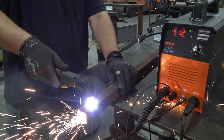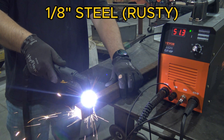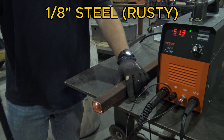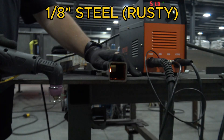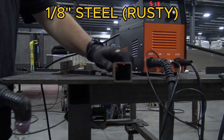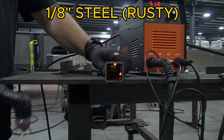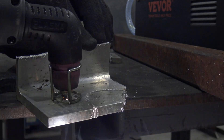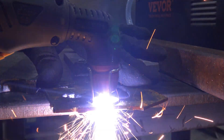Finally, I found some small steel tubing that was about eighth-inch thick but pretty rusty from sitting outside. One of the advantages of a pilot arc start plasma cutter like this is that it doesn't need to scratch start with the material. Normally you need a clean surface for the arc to start, but since this is a pilot arc, it can punch through paint, rust, or oxidation without any problem. If you work with painted, galvanized, or rusty materials, a pilot arc will make your life a lot easier. That said, you should never vaporize any coating without proper ventilation — it puts out bad chemicals that are definitely not good for your lungs.